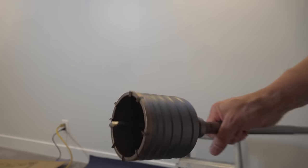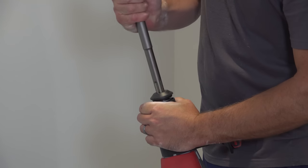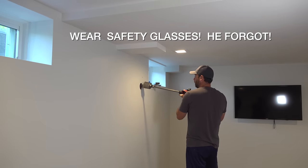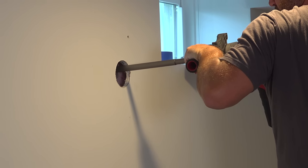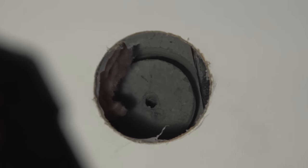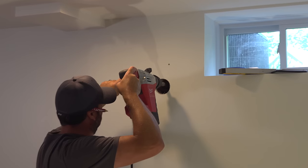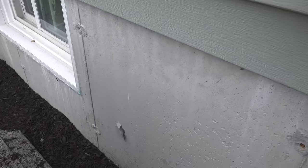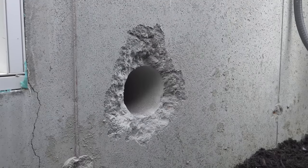At the end of the opening there was 10 inches of concrete to go through. Going through concrete might sound like a big deal but it's easy if you know how. We used a special hole cutting saw designed for this job, along with a special hammer drill. The key is to let the bit do the work — don't push too hard or you'll wear it out. Since the bit is only about 4 inches long and the wall is 10 inches, when it bottoms out you remove the core using an inexpensive bar to break it in two. Then replace the bit and keep drilling until you break through. We were really excited when that bit finally came out the other side, and the small concrete damage on the outside is easy to patch.